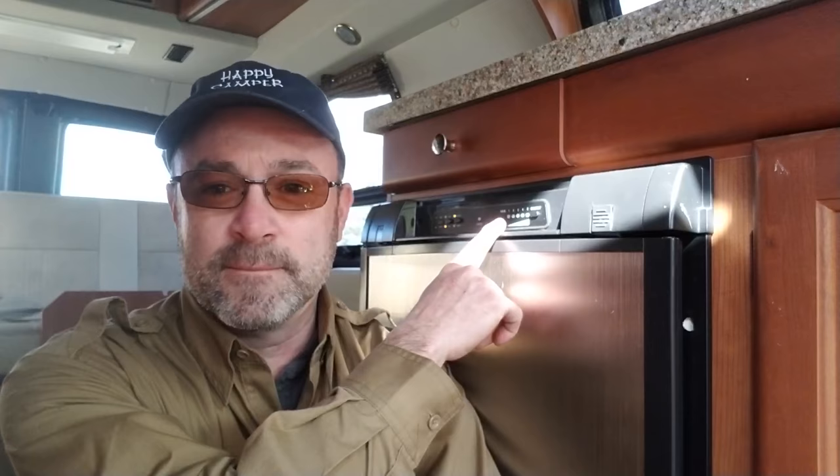How long should the boiler turn on for? That's where the one-through-five setting comes in. Think of it like a toaster where you have a gauge on the front with one through five. I like toast, not warm bread — if you're going to make me a sandwich, I want that golden crust. My wife likes warm bread, so we always need a toaster with that adjustment. She's a one, I'm a five. That's what this setting is. On the toaster it doesn't mean one minute, two minutes — it's just an interval. Five intervals is longer than one. So all that is an interval, just to get your head wrapped around what these things are.